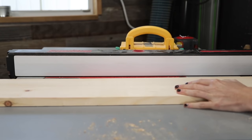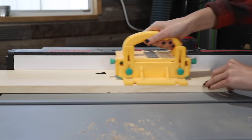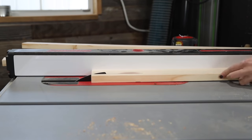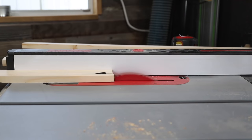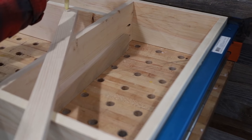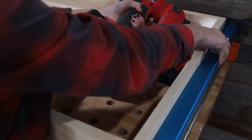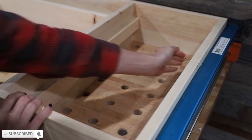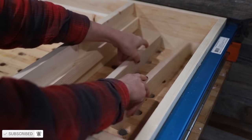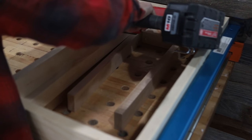With the bulk of the frame built, I decided to add pegboard to the side with the divider so I could hang clipboards or office supplies. To do that I needed to build out a small frame so the pegboard could float enough to stick pegs on it. I cut my own 1x2s out of leftover 1x6s on the table saw — though you can just purchase 1x2s. I attached them using brad nails and wood glue with spacer blocks for consistent spacing. A quick word of advice: make sure there is enough clearance at the front of the pegboard frame for whatever hinges you'll be using.